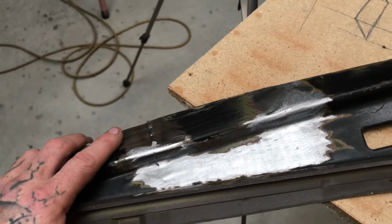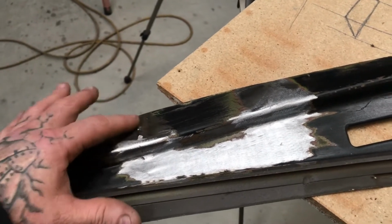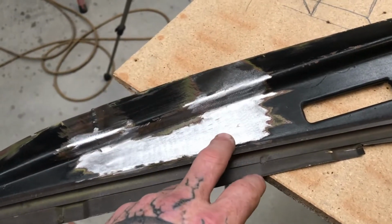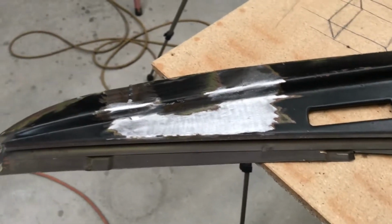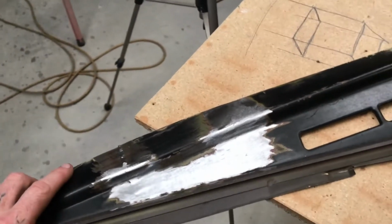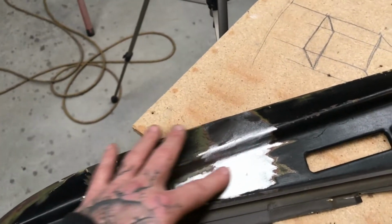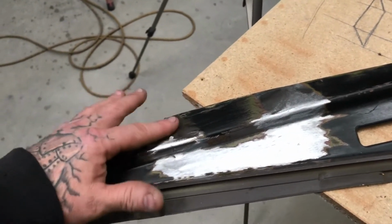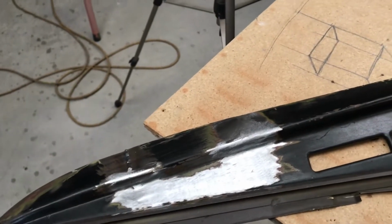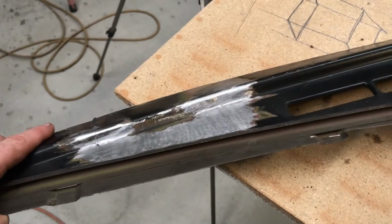I think I said in the first episode about glazing your discs. Just keep it silver, don't let it turn blue, just move about. And if you've got your elbow leaning against something so you can support yourself and hold the grinder on a supported arm, you'll find it a lot easier to float the grinder across even a lumpy weld, and you'll soon knock the tops of the lumpy bits off. And once it's more uniform, it's a lot easier to get this kind of flat finished product.